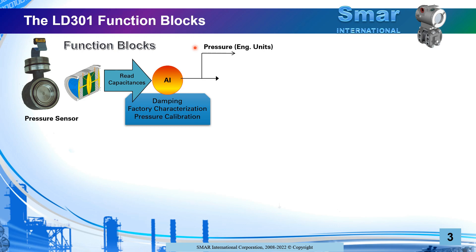At this point, you know how much the actual pressure is. This pressure is what we call pressure in engineering units, and it will be expressed according to the engineering units you set up in the transmitter. When we have a pressure in engineering units, it can be converted to a percentage. The percentage is based on your configured range — you configure what pressure will be your 0% and what pressure will be your 100%, and based on that range and the measured pressure, you get the first percentage variable.